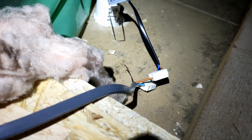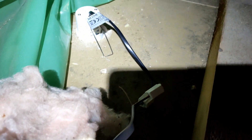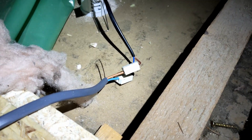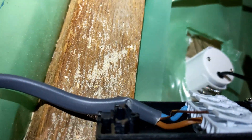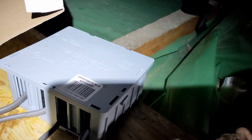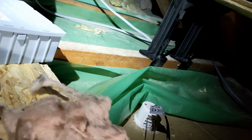All the cables will be up here and out of the way, so I'm having to leave more cable than I would normally, and all the boxes and things will all be mounted properly — but that's for another day. Coming over to these lights now, I've got to run an extra cable down for the kitchen lights and intercept the power cable. I just wanted to show you this — this isn't done right: there's no earth going to the lights, and there's no junction box of some description. Here's the other one where the cable's been damaged — that's not been done correctly either. So I'm going to rewire these correctly.